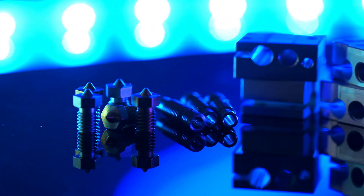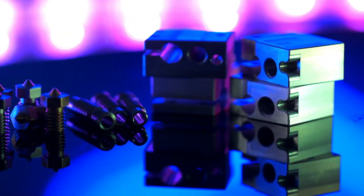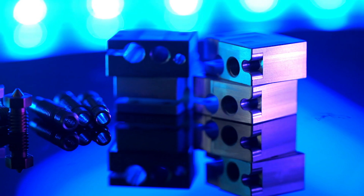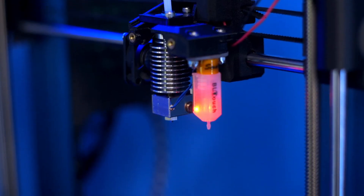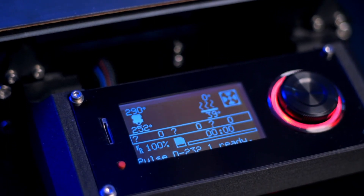Featuring a coating of tungsten disulfide, our Clean Tip nozzles, heater blocks, and heat breaks have even less friction than PTFE, meaning no filament sticks to these parts inside or out. The tungsten disulfide coating also allows these accessories to withstand up to 650 degrees Celsius. And when your hot end is up to printing temperatures, these nozzles can be wiped clean with little or no effort.